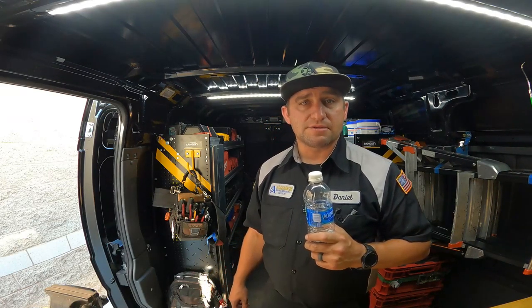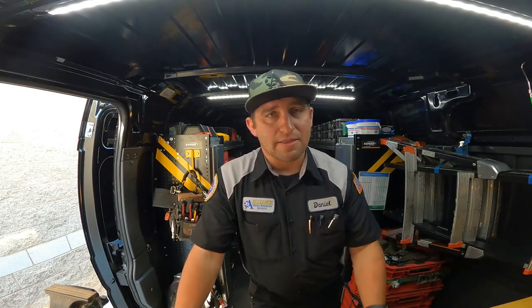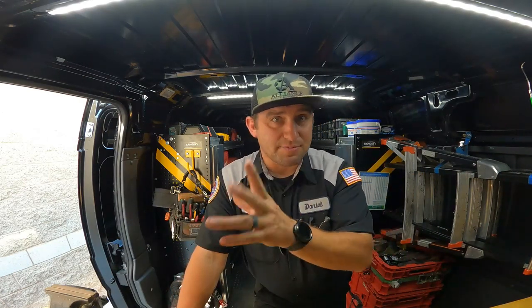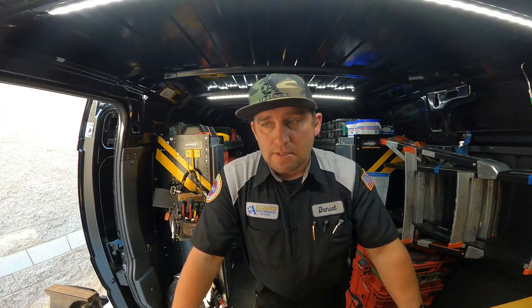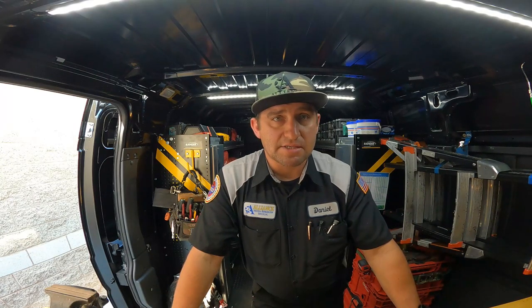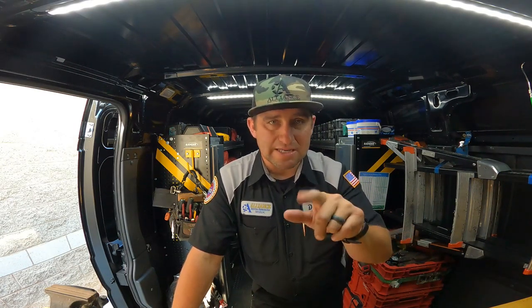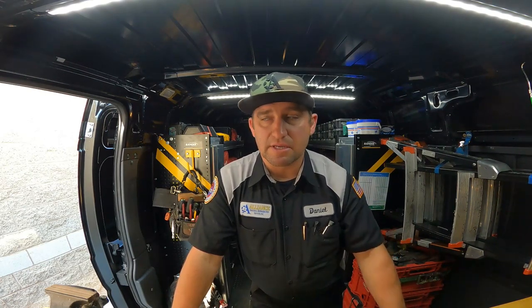Replaced that pump on the condenser there. It's a pretty small pump. Kind of sucks the way they ran the wiring and had the splice way up in the middle there. So I just re-spliced it where they did and put it all back online. I put those extra zip ties on there where I tape. We use the tape to hold it together, and put zip ties over those so the tape doesn't come undone.